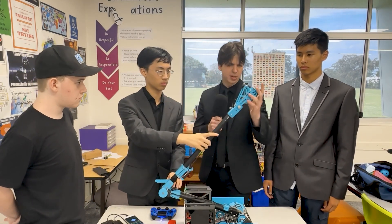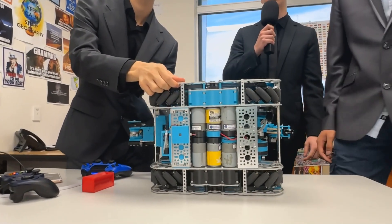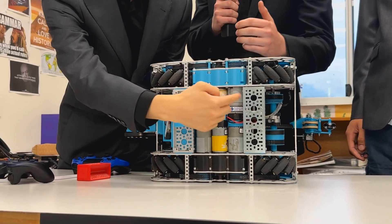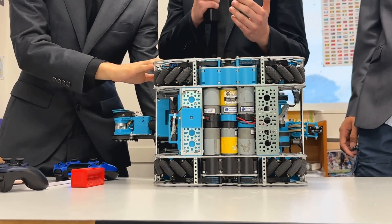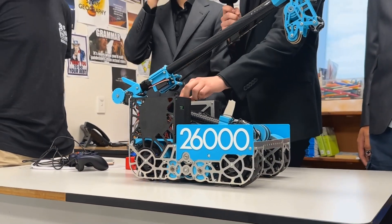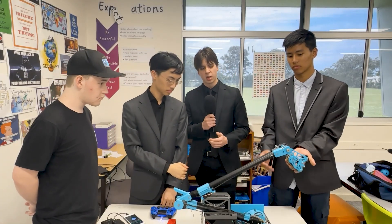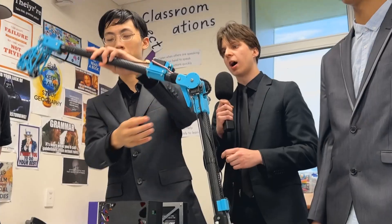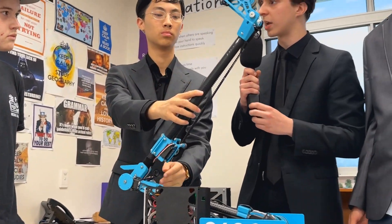On top of that, there've been a few unique design choices because of it. One of them is the packaging of our robot — we're within a 10 by 11 inch drivetrain, which is very small. What we've done is we've tried to lower our center of gravity as low as possible by having all of our drivetrain motors and our arm motors on the ground. That has led to some issues with backlash, which I can bring up later. Going into the design, we just wanted one system for intaking and outtaking and not have a transfer, because we'd had issues with transfer stages in previous teams. We just needed something that would get us through our regionals comp so we could then progress and redesign and reevaluate as the season came out.